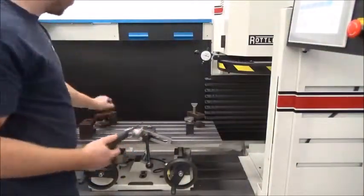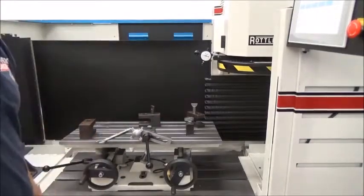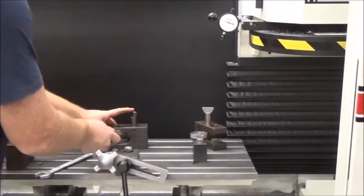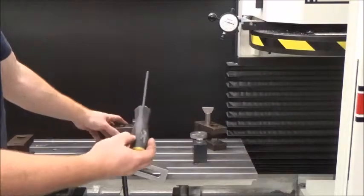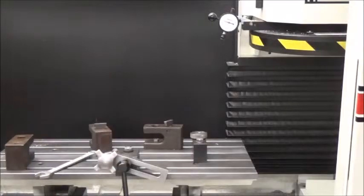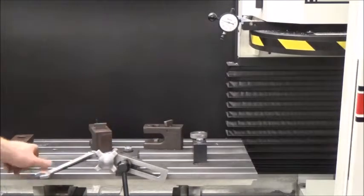Now the other thing is I'm going to loosen up these little pieces right over here. These are Allen fixtures and that is 7/32nds. For the most part, I see that the table is tilted towards the back, but that's actually kind of a good thing — so the cylinder head doesn't slide towards me.